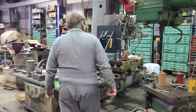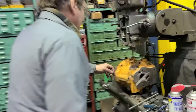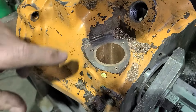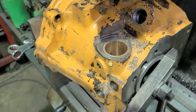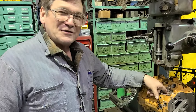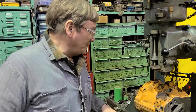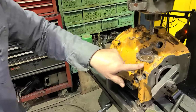Over here I've got the sleeve in the transmission, lock-tited. Before I clean up the inside, we put a screw in here as an extra pin besides the lock-titing. You can see I dimpled the other side when I was hand drilling — I went through. That dimple won't hurt anything, but if I was thinking ahead, you don't expect yourself to overshoot and hit the other side. I could have put a piece of steel in there to block it so it couldn't hit the other side.